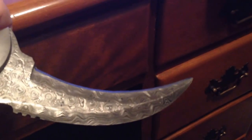You're supposed to keep it oiled, otherwise your 1090 steel will start to rust. Damascus blades do require a little bit more effort to keep them nice and shiny, rather than your normal anodized or stainless steels. But you can buff out the rust — you can use a really fine grit sandpaper to bring it back to this high shine. I'm just going to keep mine oiled.